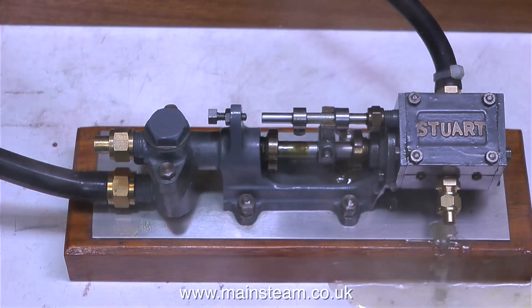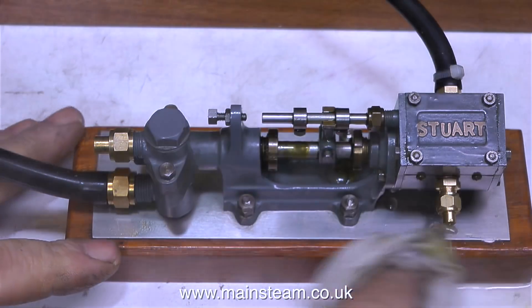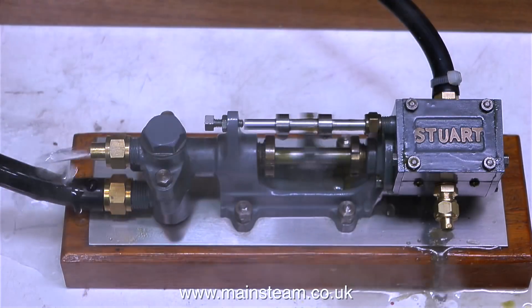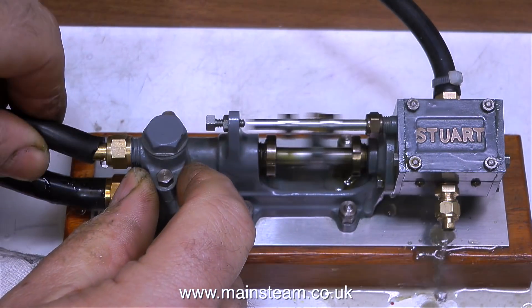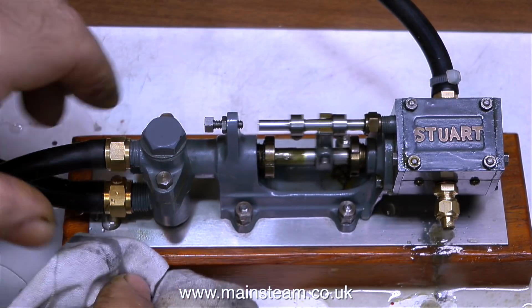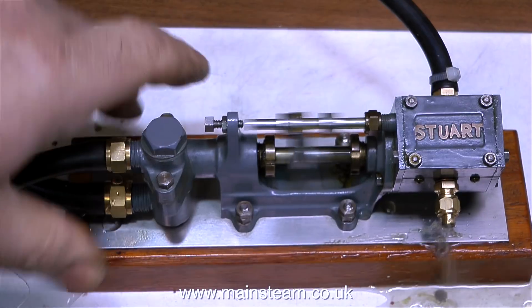That's why very conveniently I've connected this small feed pump to the boiler on the large steam plant. And as soon as I put some steam into the engine, it starts to run. When running steam-powered boiler feed pumps, it's a really good idea to connect a pipe to the water outlet of the pump, and that's what I'm doing here. The pump is running quite erratically because the steam pump is still a little bit on the tight side.